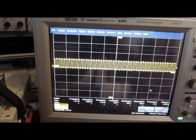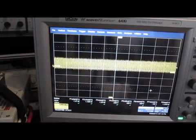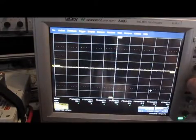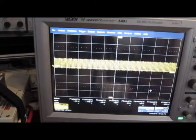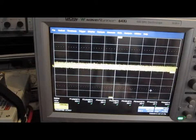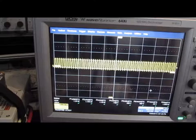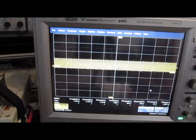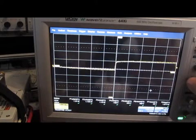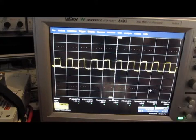This is at 10 hertz. This is 100 hertz. This is at 1 kilohertz. This is at 10 kilohertz — pretty close to the limit of the pulser. This is 30 kilohertz and you can see the pulser is fading out — that's the limit of the power I can get out of this. This is 20 kilohertz. You can see the compensation is all right, but it definitely needs another stage to clean it up a bit better. It's definitely usable right now though.